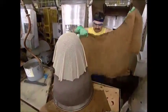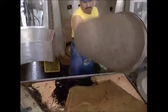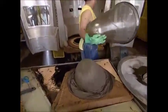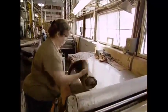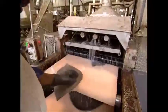At this point you've got an enormous cone, more Harry Potter than John Wayne, but it's still early in the process, so hold your horses. A cowboy hat has to be tough, so the fibers need to be well bonded. The cones are twisted into a cigar shape and placed on rollers. The kneading, rolling motion will knit the fibers together. Each one is rolled and then bathed several times. By the end of the process, the material will have shrunk by almost 60%, but it still doesn't look very Wild West just yet.